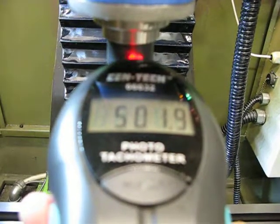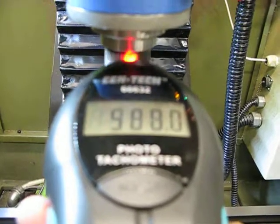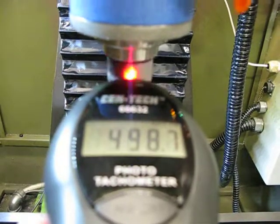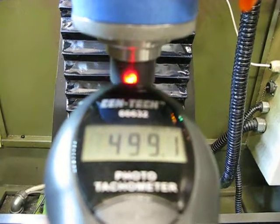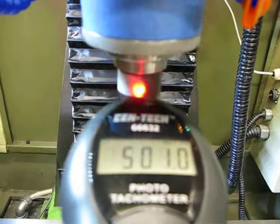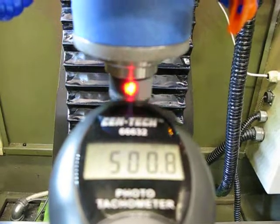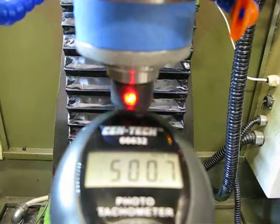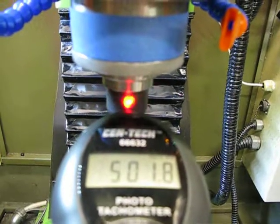That's how I got the spindle to be accurate. It's weird because the minimum speed's not really zero and the top speed's not really 7900, but this configuration results in the spindle speed being accurate across the range. An upshot of having a different pulley ratio is that I get a different top speed - the normal top speed is like 5000 RPM, but this one will go up to like 6500.